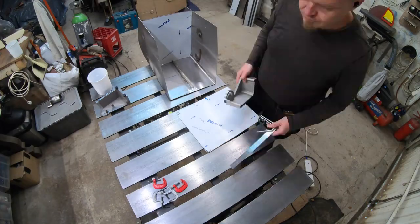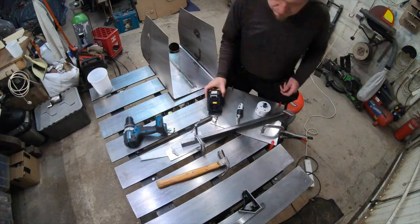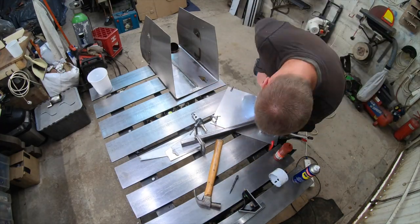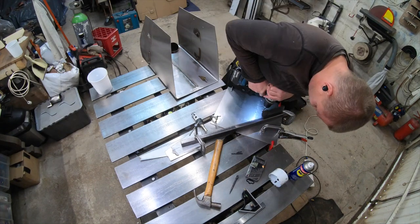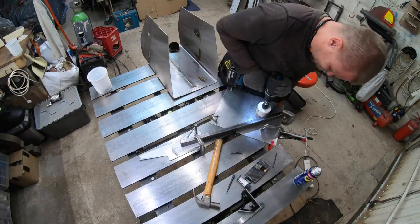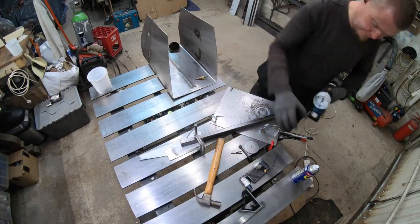Once the sheets were cut, it was time to make the holes in them. Again, I'm fighting with my dull drill bits to get the pilot hole drilled. I later learned that I should have just used the drill on the hole saw to do this, but I ain't no clever. And I'm still surprised at how efficient the hole saw is. A bit of patience and some lube, and we had penetrated both holes in no time.